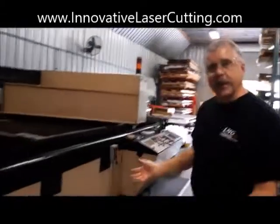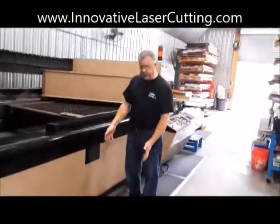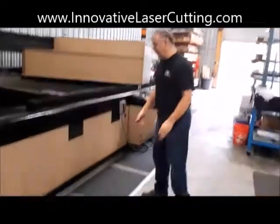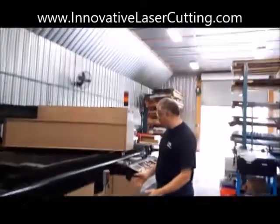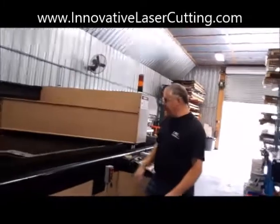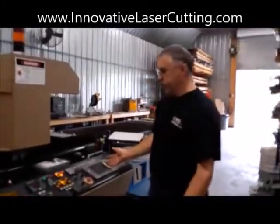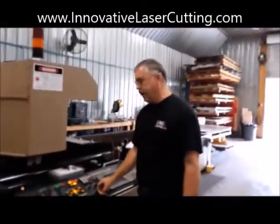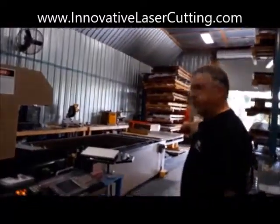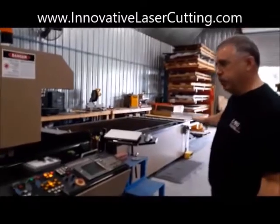When we come up to a laser, the first thing everybody wants to do is get right up and look. The safety mat is going to shut that down. It's one of the most important safety features on this machine. If I step on this mat, it stops the whole machine right down. We have two ways to stop the machine: an e-stop here, or a quick stop with a feed hold here. There's also a feed hold at the end of the machine — that'll interrupt any motion.